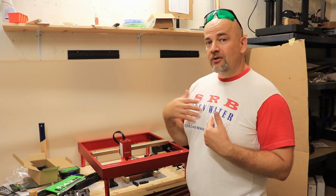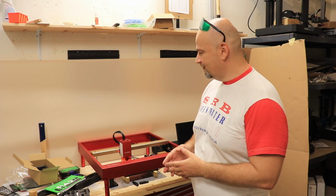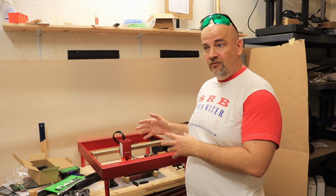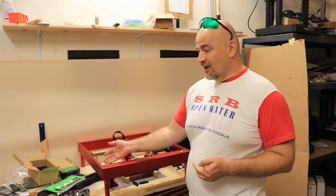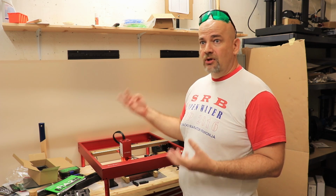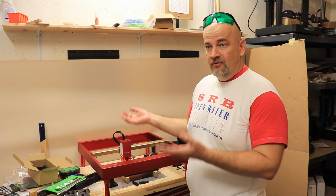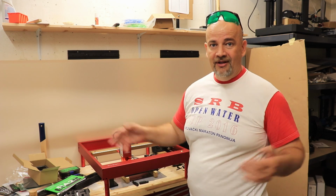Design is great. According to my wife, this is the best laser engraver I tested so far because of the design and the color. Okay. With D1 Pro I don't have that feeling that this is another 98-99% finished product. Everything works, hardware, software, and they work together perfectly. Small details. I really like these metallic wheels on steel rods. They will be much more durable compared to the rubber or silicone V-slot wheels. Another small thing, the fan of the module. It will be disabled when the module is not in use. Of course, it's logical, but that's not the case with every laser engraver.